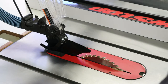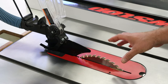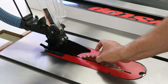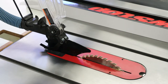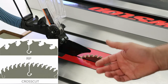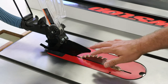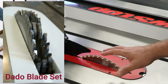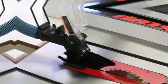The next parts I wanted to talk about on the table saw are all of these parts up here by the blade. This is the business end of the table saw and where all the action happens. We're going to start with the blade itself — you've got a plate and then teeth attached to the outside edge. Table saw blades come in multiple varieties: you can get one specifically for cross-cutting, one specifically for ripping, or a combination blade that does both. They also make specialty blades like a dado blade that cuts a very wide groove, and blades made for man-made materials like melamine.